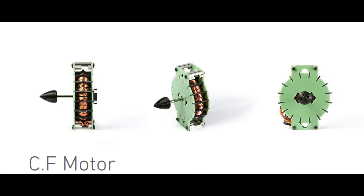Then somebody said, 'Instead of making it go up and down like a standard solenoid, how about we make it spin round and round?' - and that creates a circumferential flux motor or generator. This was the brainchild of Motion Robotics, though circumferential flux motors have been around a bit longer in the literature. What Motion Robotics claim to have done is built the first real working version. The advantage is you get full use of the magnetic field without needing Halbach arrays or lumpy bits of silicon steel, making it much lighter and shooting the power-to-weight ratio right up.